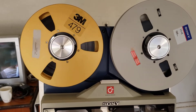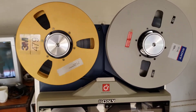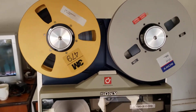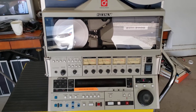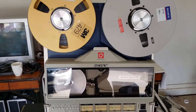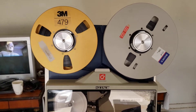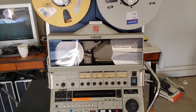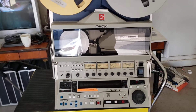There are two reasons for this. If you try to copy a tape directly from a machine like this, sometimes these machines are not perfect. These tapes have all kinds of flaws and issues. If the video heads are really dirty or the guides are off — and a lot of people mess with the guides on these things — it's going to throw the video signal off. It might look good on your television, but when you try to copy it to a DVD or something like that, different electronics interpret the signal differently, so the video may not look that good.